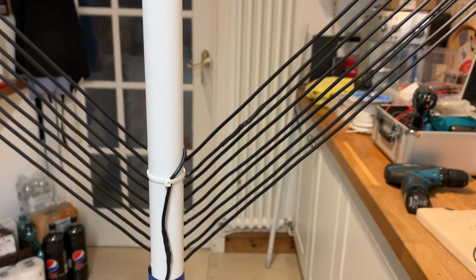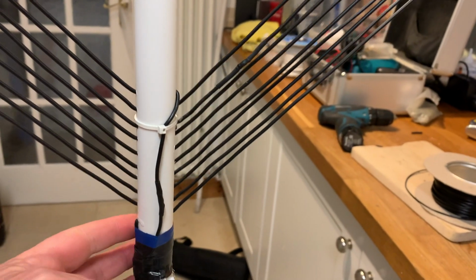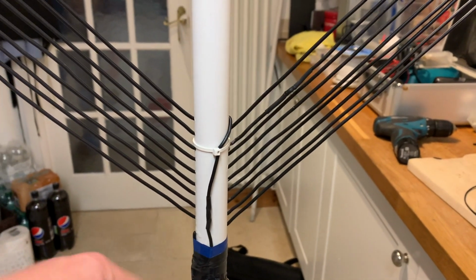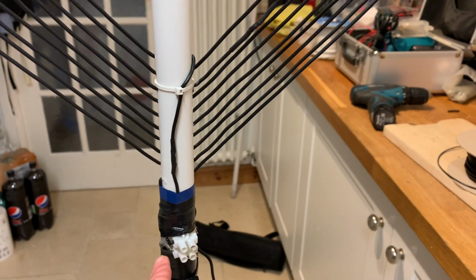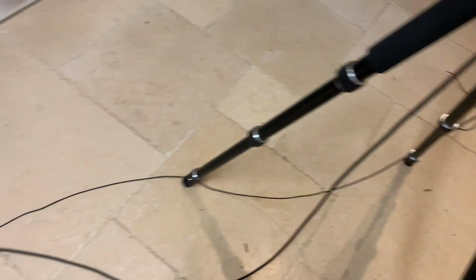So this is quite literally 16.9 meters of wire on this frame. I will put all of the sizes and stuff in the description below. And what I've done is this is purely an antenna. The counterpoise is here. It just runs across the floor.